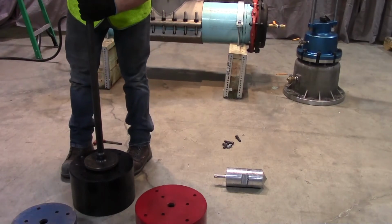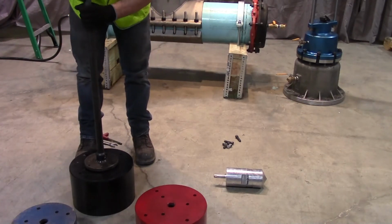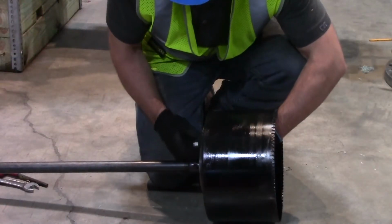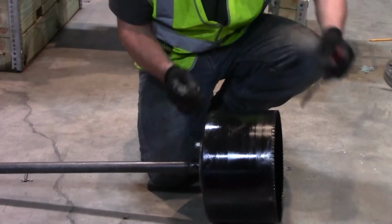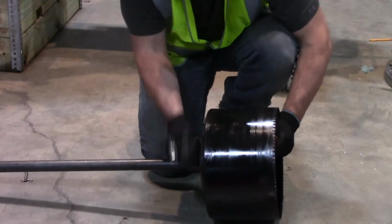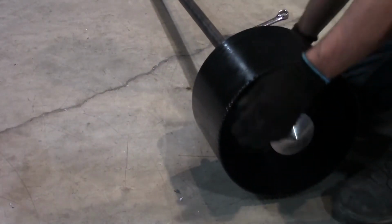Refer to Appendix E in the installation instructions to select the proper cutter for your installation, and then thread the saw mandrel to the cutter. Bolt the cutter to the saw mandrel using the standard cutter hardware. Insert the 4-inch centering tool into the pilot bit hole, align the through hole, and lock in place with cotter pin and clip.